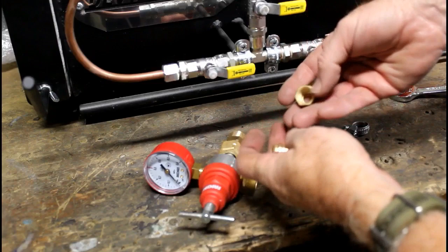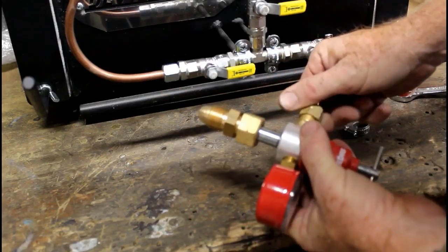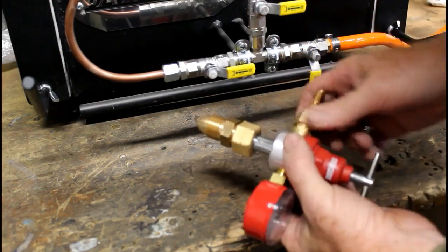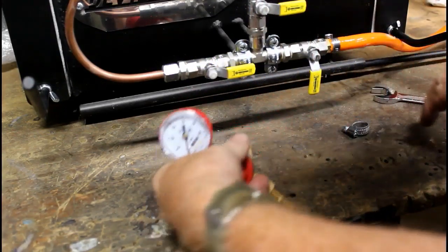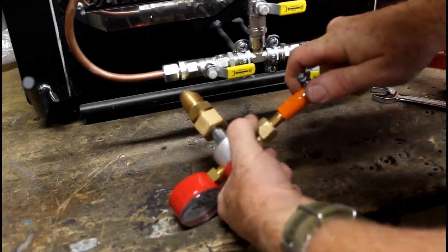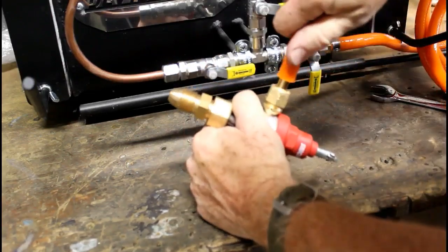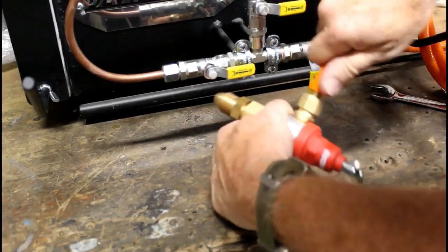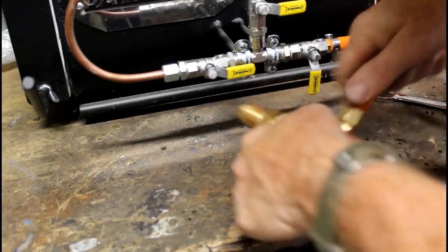This is the regulator. It comes with all of the fittings. You want to assemble the nipple fitting as shown. This can only go on one way. It is a left-handed thread. And just as with the other side of the hose, you're going to slide the hose clamp onto the hose. You're going to push that hose all of the way onto the nipple. Takes a little bit of effort. And once that hose is all the way onto the nipple, then you can secure it with that hose clamp. And basically the same deal, screwdriver and then cinch it up with a little wrench.